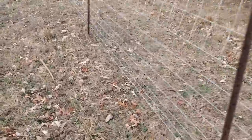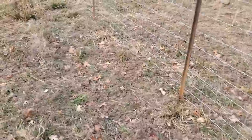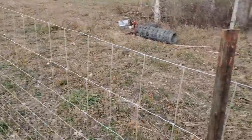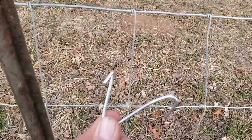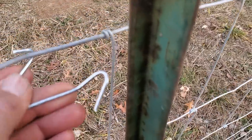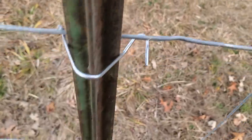Sorry about the wind — this is real life and I'm not going to sugarcoat it, it's windy out here. I'm going to show you all a little secret I just showed the boys. They're up there with pliers and getting along kind of slow trying to put them on. Someone had no time to teach me this a long time ago. So there's your clippy — this is the way they come, already pre-bent. You reach around, pull it around your T-post like that, and then stick that up right there.